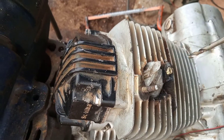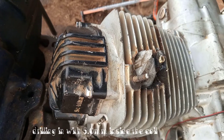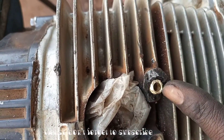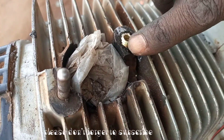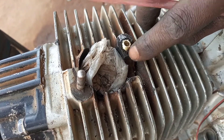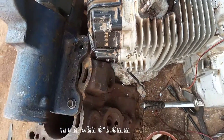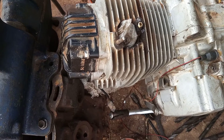Always keep in mind to be in a straight line. As you can see the helicoil is slightly protruding out, and we have drilled in — there are no threads inside yet. The helicoil is a bit out because this part was welded and this is aluminium, so the welding took effect and this part got melted. You have to leave it as it is. Let's tap in with a 6.0, M6 x 1.0, because that is the size of the threads of the original bolt.